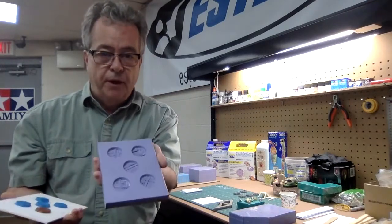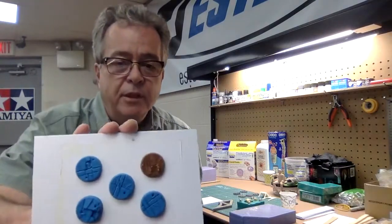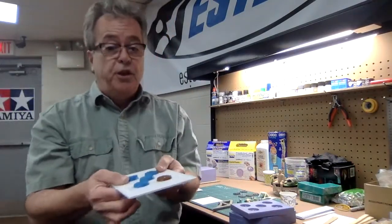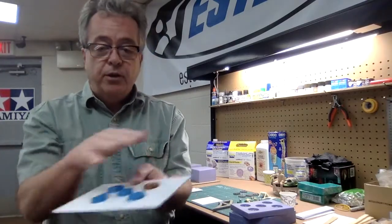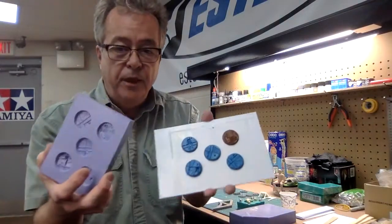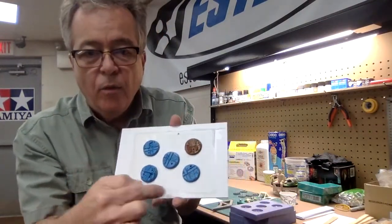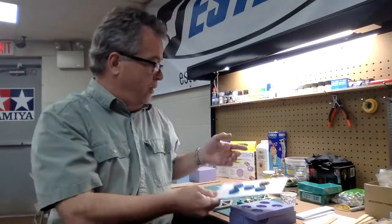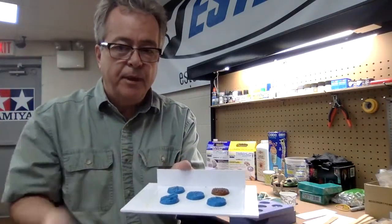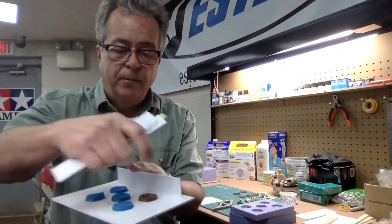The first type is a single-piece mold — an open top mold. You can see these are the little bases for the figures. I took a sheet of styrene and glued down the bases onto the styrene, leaving a little border around them. You can see where I had plastic glued on there. You build a box around the parts using sheet plastic so that you can pour the rubber in and it makes the mold. I cut sheet styrene to size, glued it right on top and all the way around — you make a square box.